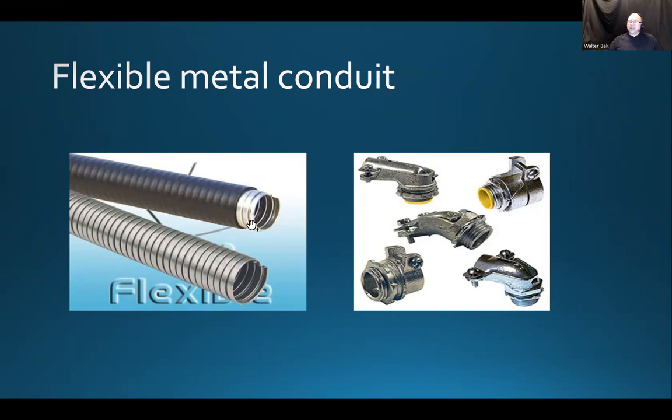One thing I'm going to tell you is that you need to buy those extenders, and I'm not mentioning that here. If you run a longer straight pathway or raceway, then the temperatures, high and low, going up and down, will cause even PVC piping to expand and contract. So next time I'm going to include that, but I just want you to know that once upon a time, you need to have that little accordion-like flexible piece that is going to compensate for expansion and contraction of the conduit.